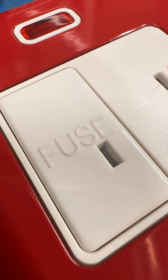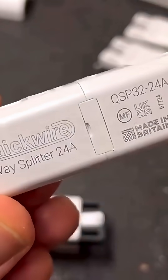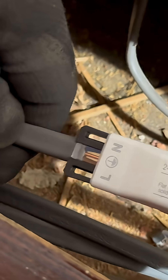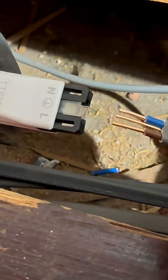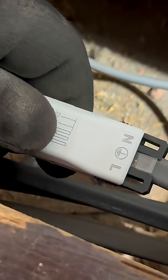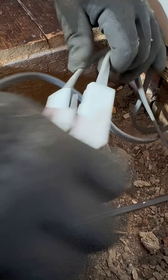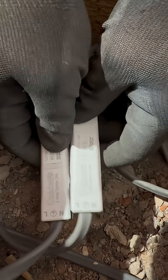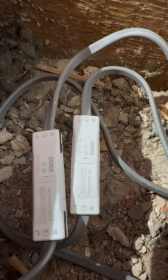But if it was a fuse then that would lead to some interesting situations. For instance, if it's a maintenance-free connection installed somewhere inaccessible, how would you replace the fuse if it blew? And if you used it to repair a cable in a ring final circuit and the fuse blew, you'd then have two radial circuits connected to a 32 amp MCB. In both cases that could present a major problem for your circuit.